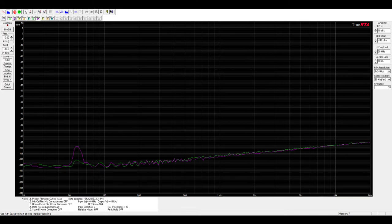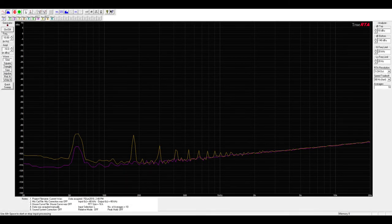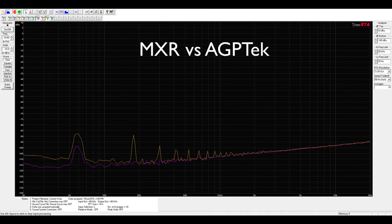So what's going on? Don't some people get noise in their rigs when using switching power supplies? Is it fake news? A conspiracy by makers of expensive transformers? Well, it's really just a matter of getting the best thing for the job. Here, the orange line is the low-cost power supply, and we can definitely see some increase in noise. It's not terrible, but it's there. Some can be much worse, but switching converters that are properly designed for audio use filter this out, or move it into frequency ranges outside the audible spectrum.